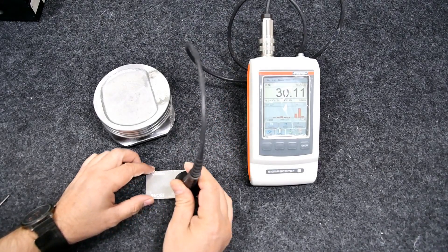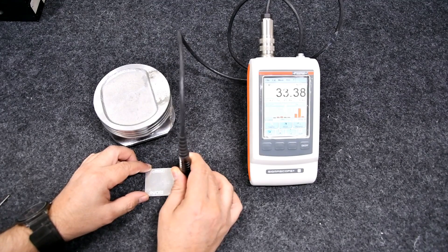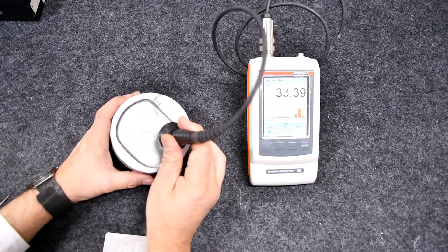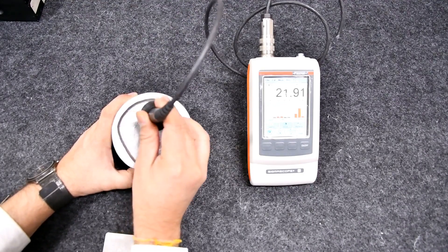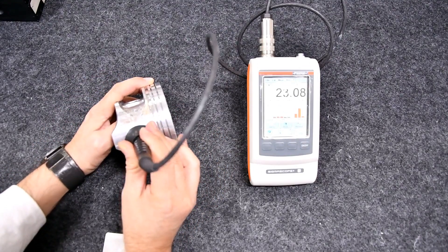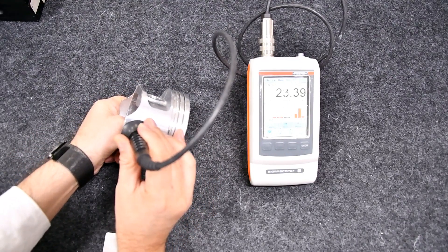Similarly, we can use either the FS40 or FS24 probe for measuring aluminum conductivity. We can calibrate aluminum samples and take conductivity measurements of aluminum. You can have a flat sample as well as a curved surface for measuring electrical conductivity. Taking multiple results on a curved surface always helps to reach precise and conclusive results.